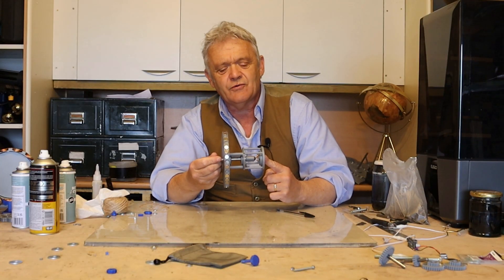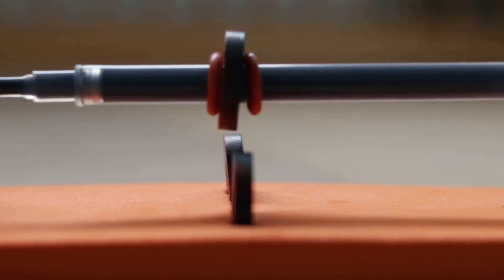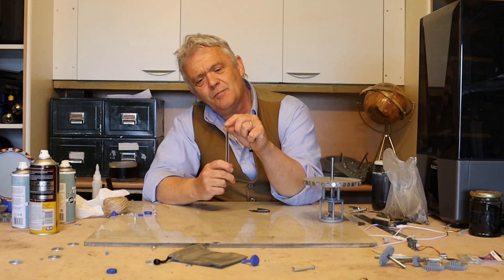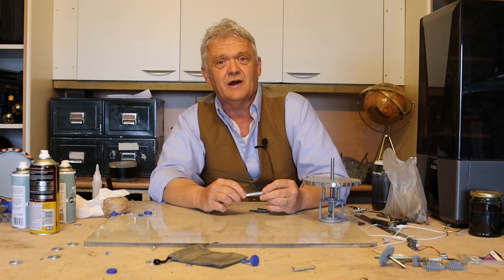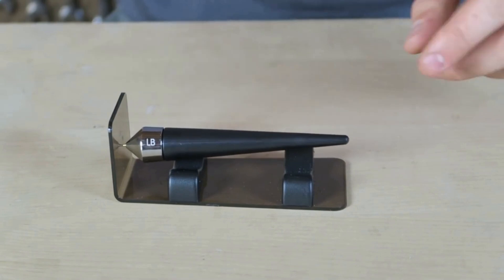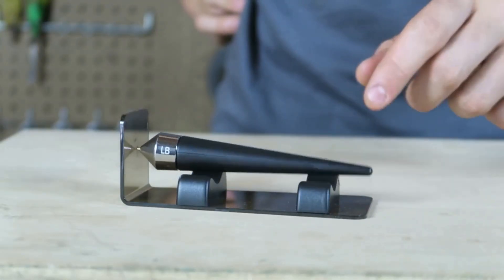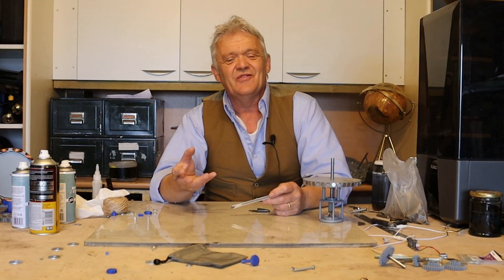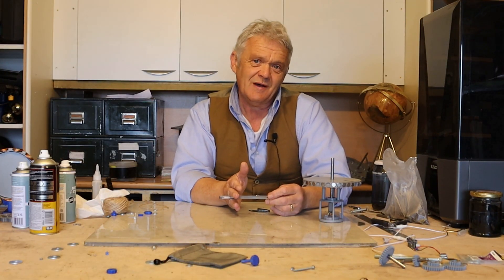There are quite a few videos on that — the magnetic floating pen, for example. You get a magnet arrangement, take your pen, put it against a bit of glass, and it will suspend in midair and rotate because it's got a ball bearing acting as the pivot. The magnets shove it against the glass. They're really easy to make and very popular. But there is a serious problem: when you rotate it, it bounces around and wobbles.